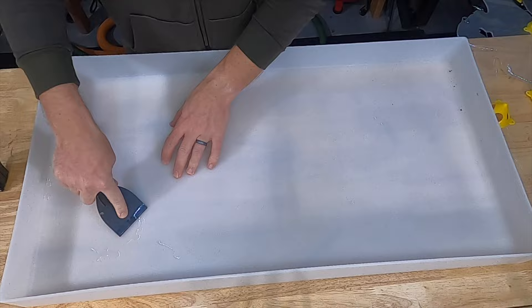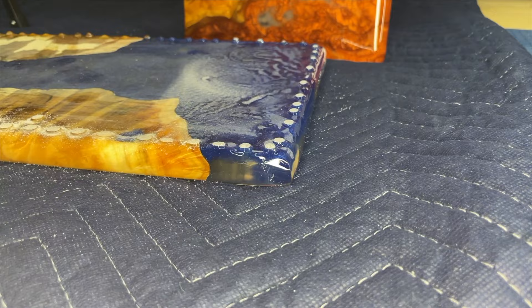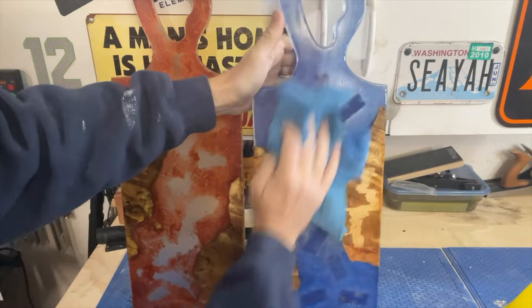Here's why I like using the Crafted Elements HDPE coffee table mold — all of the overflow just pops right out and clean up is a breeze. Now is some dirty work. I'm going to sand all of the drips off the bottom side of these charcuterie boards. I take 80 grit, try to get as many of the drips down as flat and flush as possible, and I start working my way with the sander all the way up to 340 grit. Once done I vacuum off all the excess dust and then wipe it down with water to get ready to apply finish to the back.